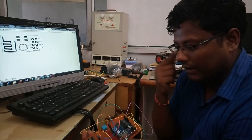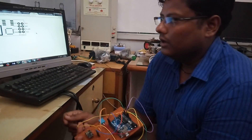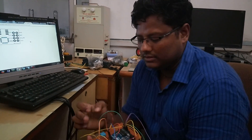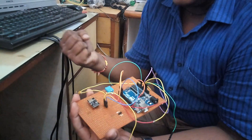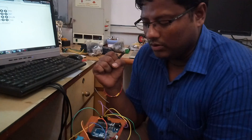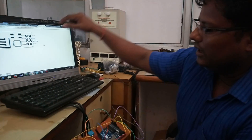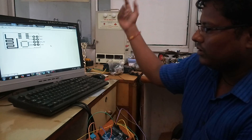I would not directly suggest using your Arduino's 3.3 volt pin. The better way is to connect an external 3.3 volt supply module, because this wireless module is going to drain more current out of your Arduino, and that can blow your Arduino port. For testing purposes you can connect it to your Arduino 3.3 volt power point and connect ground to ground.